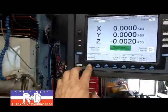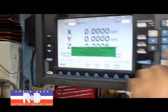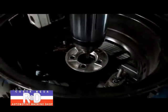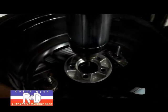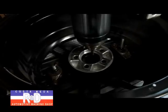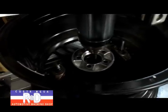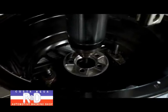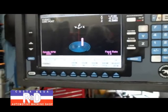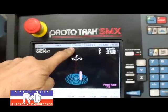So we hit Run, Start, Go. Turn the spindle on and go one more time. This is actually starting like it's cutting out a complete circle, so we have to kind of wait for the machine to catch up to the wheel. We can watch the path of our cutter here on this little diagram, which makes it real nice. And if you look up here, this is how many minutes we've got left in the program.